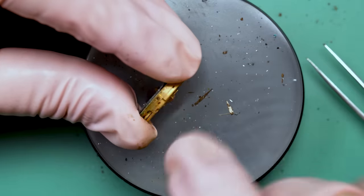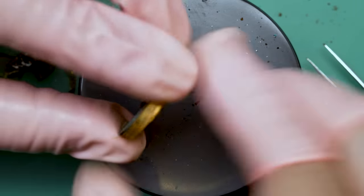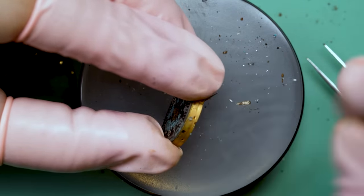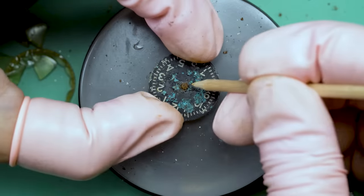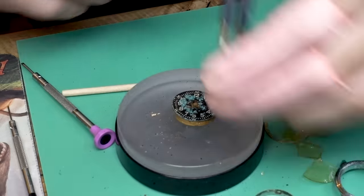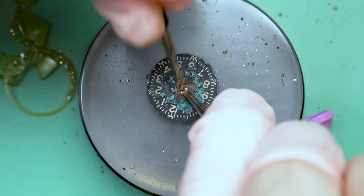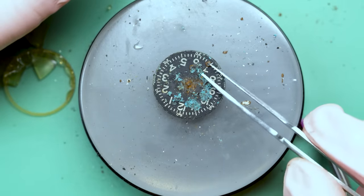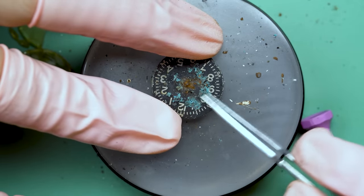I'm trying to take off the dial screws here — they're also rusted. This is requiring a lot more brute force than I would normally want to give a watch, but I don't really see how I have much of a choice. The hands have rusted off, but is there actually a chance there's still the base of the hand on there? And it looks like after I clear away a little bit of debris that there is. Let's just take this off and see if it'll come up or just disintegrate. There we go — those were the original base of the hands, also rusted on. But thankfully they came off.